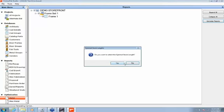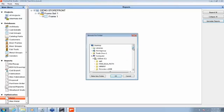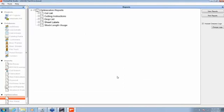So we're going to go on by the edit. We don't need to do anything on the optimization. It comes to the point where we're ready to transfer these files out. At this point we tell it yes, and it asks us where we want to store those. I'm going to be storing those onto a USB drive. You could also have this directed to a network path where these files are stored up on your network, and then they're pulled down off the network at the RhinoFAB machine. In this case, I'm putting it right onto a USB drive. Okay, and now that's been saved out.